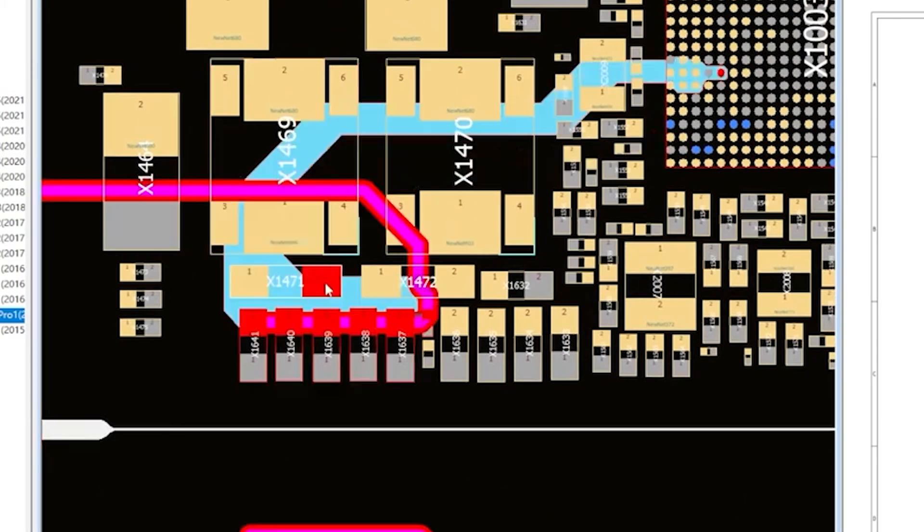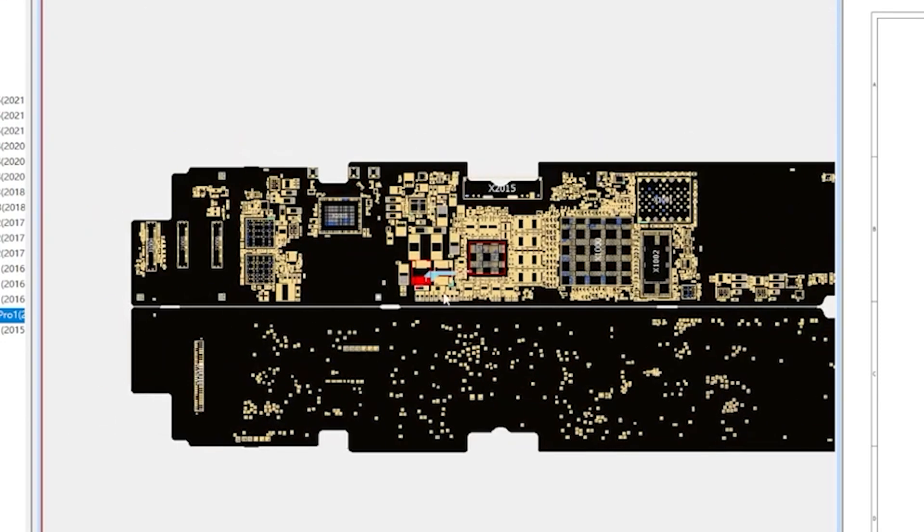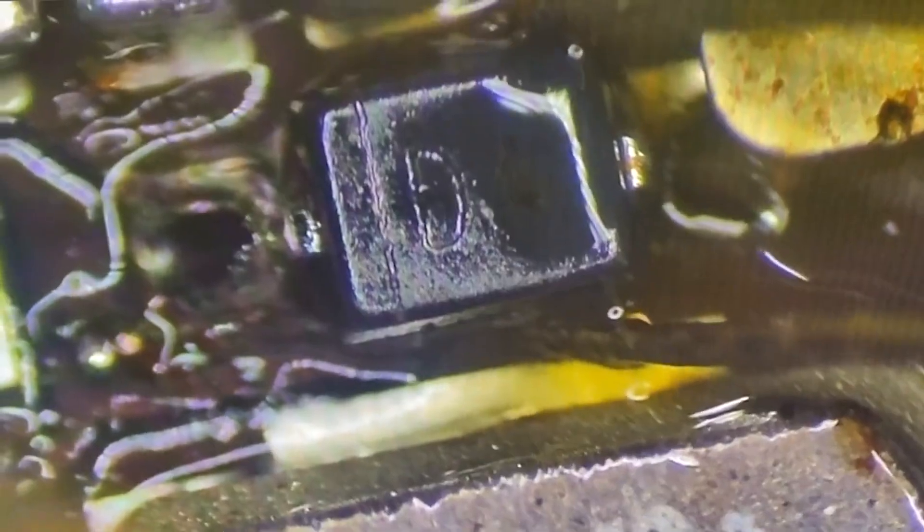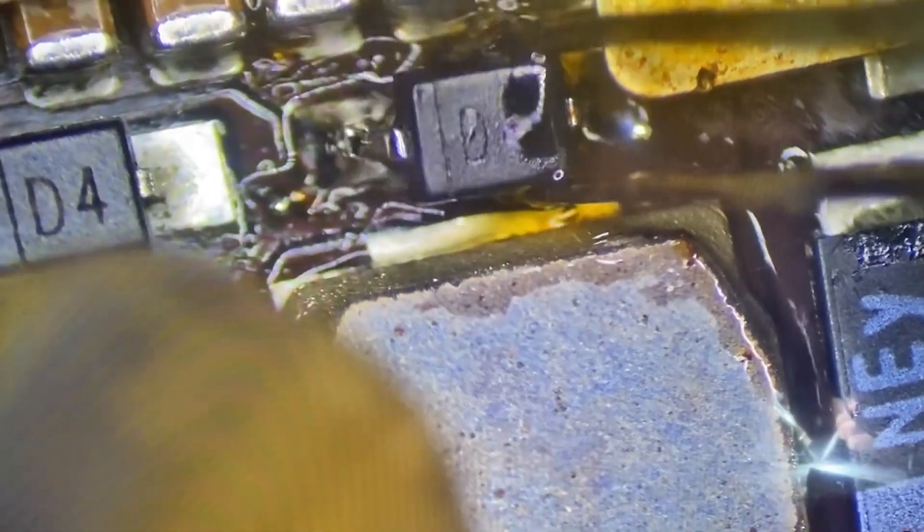This should be the only component I have to replace, and I'm going to do so in the same way — by adding some lower-melting-temperature solder to both sides. This will not only help me get it off easier, but it'll also make soldering the new component much easier and I won't have to bring the board up to a higher temperature, potentially causing other issues. I'm going to grab the same component off of my donor board, making sure I keep it in the proper orientation because it does matter — so I'm going to make note of where the line is on this diode. I'll heat it up, get it off the board, and transfer it over to the new board.